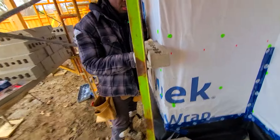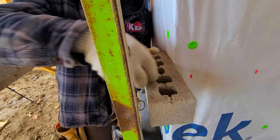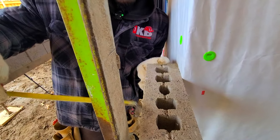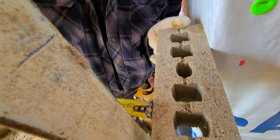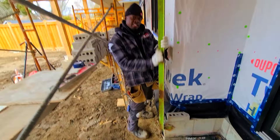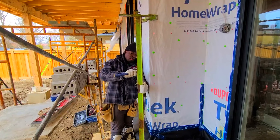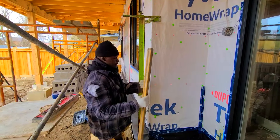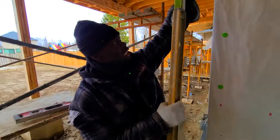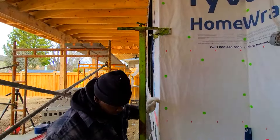If we check, we should have one inch from the brick to the corner post — that's going to be the cavity space at the back of the wall. Now that this side is set up, tighten it up nice and secure. Then we need to do the same thing on the other side: check for plumb, slot in the corner post, lock it in, then lift up and pull out until she's plumb.